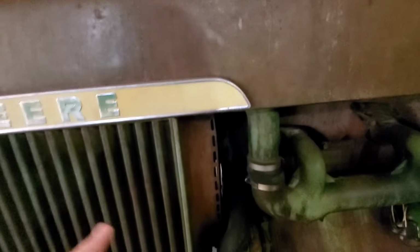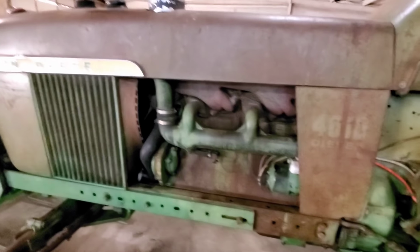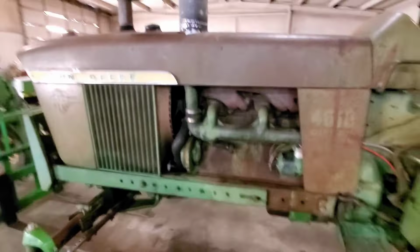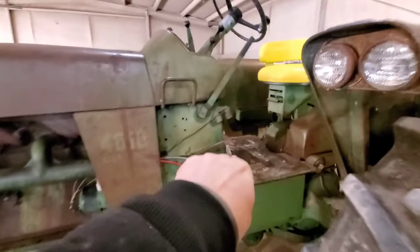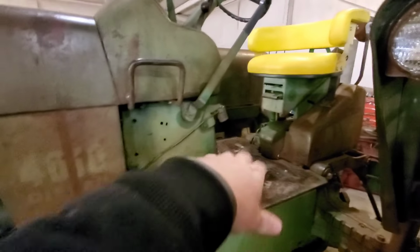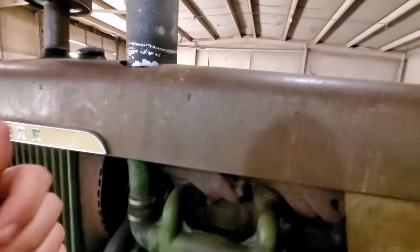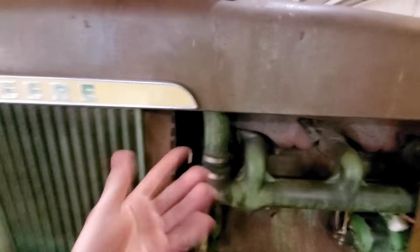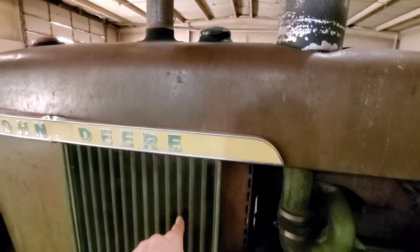Main hydraulic pump then pressures the tractor, which has a series of valve bodies underneath the hood here, attached to these levers, and then those will run your accessories. So for example, if you have a loader on a 4010 or 4020 synchro range, and you go up above a manure spreader or whatever you're dumping in, push your clutch in, and you raise your hydraulic to lift your loader, what will happen is, because that pump back there is no longer feeding this because the clutch is in, there's nothing powering that pump, the only oil you have is the cooler and little reservoir that drains into here.